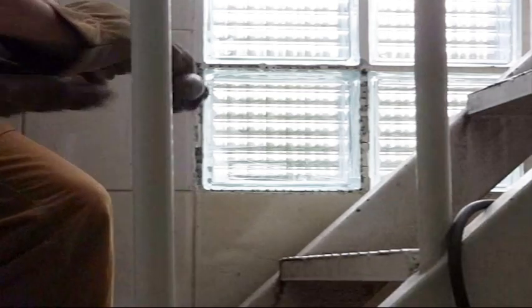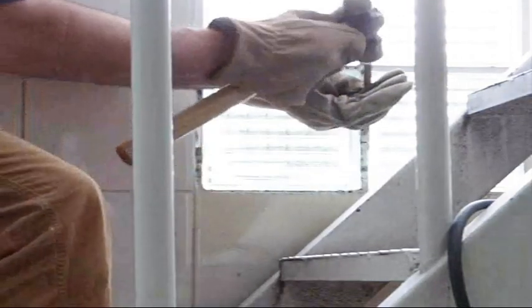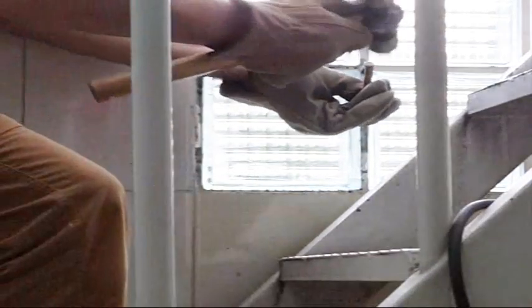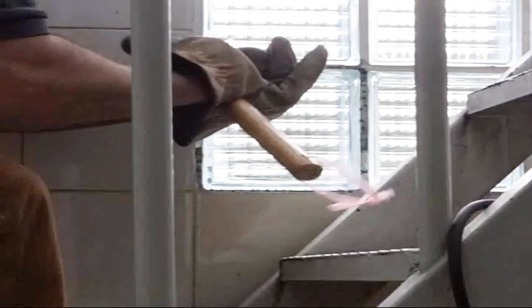I've continued around the glass block drilling it out, trying to weaken it. I'll chisel on it a little bit more — I want to be careful, I don't want to break the other block. This is pretty loose over here. I'll tap on it and loosen it some more. Give it some buffer room so that when this block pops it won't take out that block with it. You don't want to wedge the chisel straight in there because that's a guaranteed way to break things — lightly chisel it out, don't force it in there.